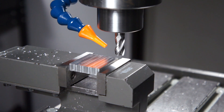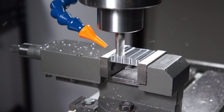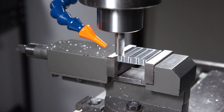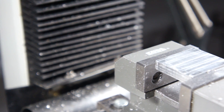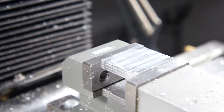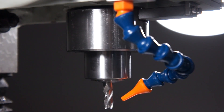And that's about it — but does it work? Well, watch. It works! It would have worked without the airline but it's just much much nicer to blow those chips out of the way. You get a much better finish because you're not recutting chips, and most of my work's in aluminum anyway so that should work awesomely well. It blows chips everywhere in the workshop now, but that's a small price to pay for a better surface finish.